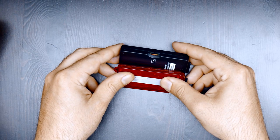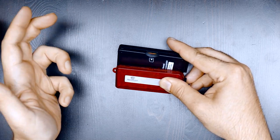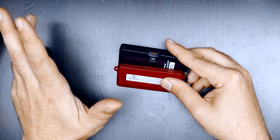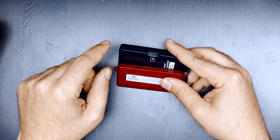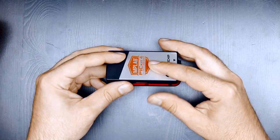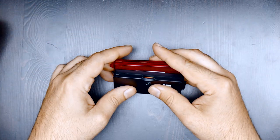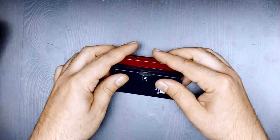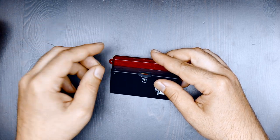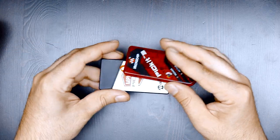On the side, you will notice there is now a micro SD slot. And that is intended for programmer on the go functionality. How exactly that will work, we are not sure because it hasn't been released yet. However, considering that usual images that you want to program are a few hundred K at most, it is essentially probably a waste of a perfectly good micro SD. I wish they had just added it on board in the form of an EEPROM chip or something like that.